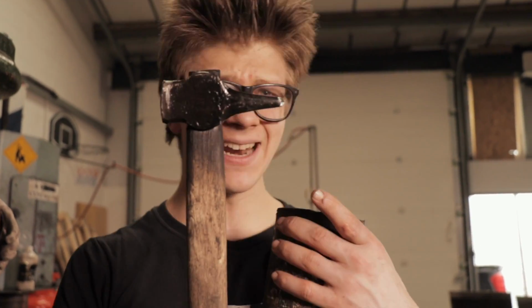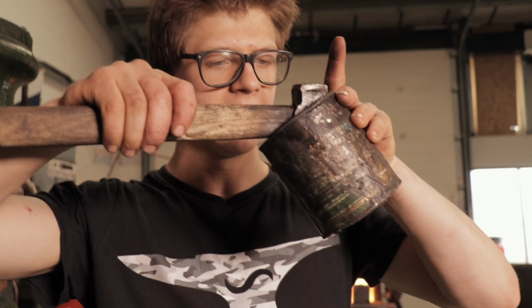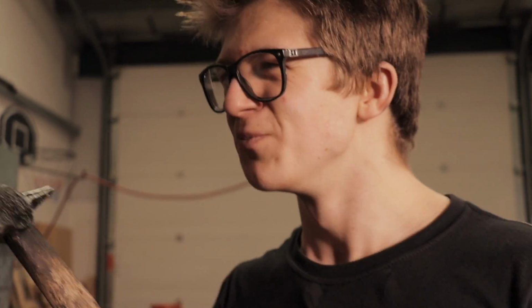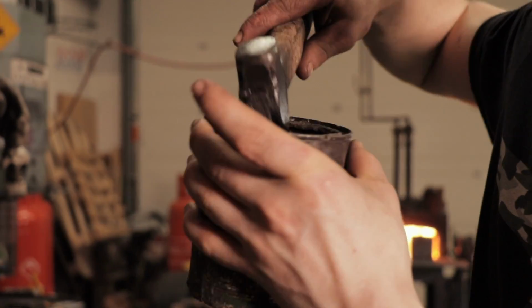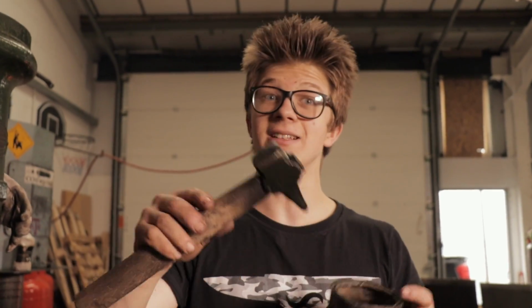But the thing is, down in the depths of that hot material, this heats up and it can deform if it's hot. So we're cooling it down in beeswax, which smells really nice. Don't you love the smell of beeswax? There's also some graphite in the beeswax to help lubricate it. As we drive it down, it's not getting stuck, and we can take it out, keep the tool cool, and be able to get a good hole in the material.